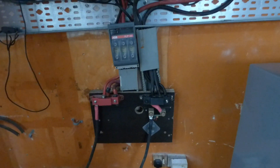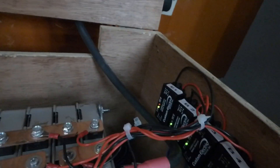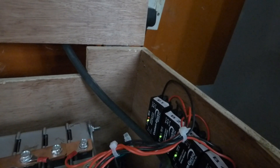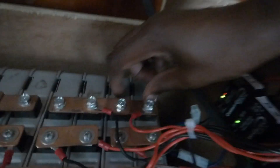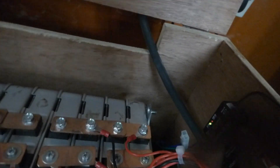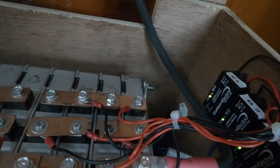So once again this is Dr. Sola. I'm going to keep making changes and I'll keep you updated as to the progress with my new battery balancers. As you can see, it's still red because this is lower than that. I unplugged one of these and the red light changed, so it's pulling from the higher ones and trying to put it into this lower one. I was expecting these things to have higher currents to charge and discharge, but it's only one amp — so it's not a lot. I have these batteries here in parallel, so I have one amp to this one and one amp to this one, giving this module two amps on it, which is a lot in my opinion. But this thing is slow as molasses.